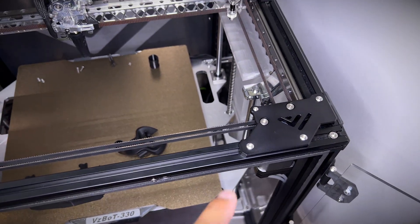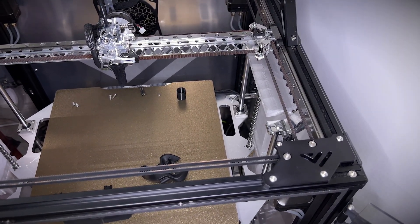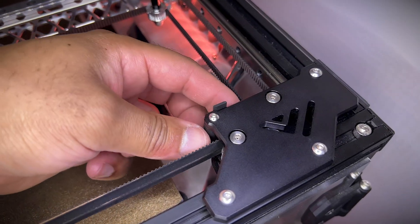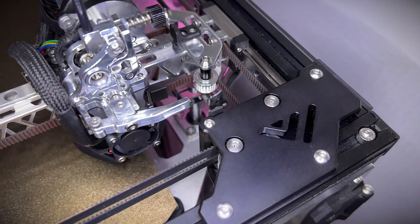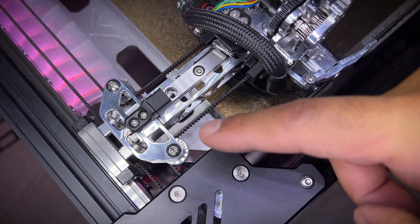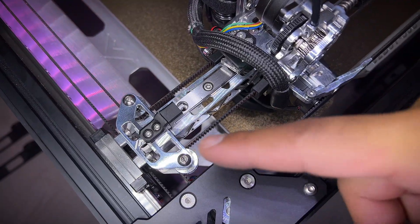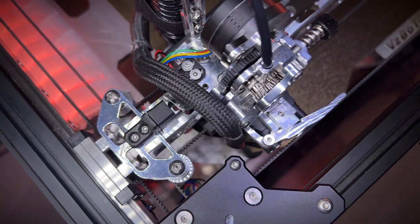I also had to print a part that will press the Magneto's lever to cut the filament, and then modify a few things in printer.cfg. Everything is done — here I added my Magneto stopper, or bumper, I'm not sure what it's called. On the X-endstop I added an extension; the final STL will be in one piece. I just didn't want to take everything apart just to change the X-endstop, and this will prevent the Nichrome wire from hitting the gantry.